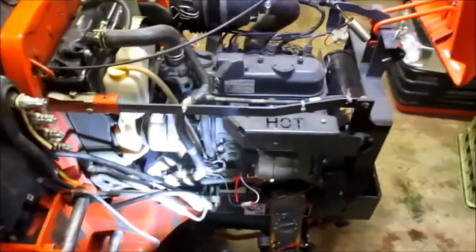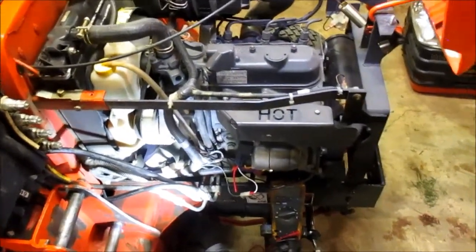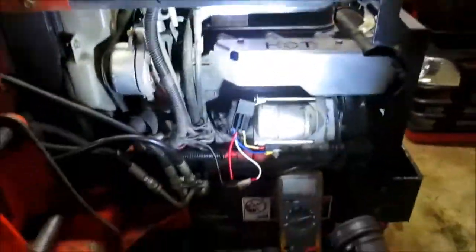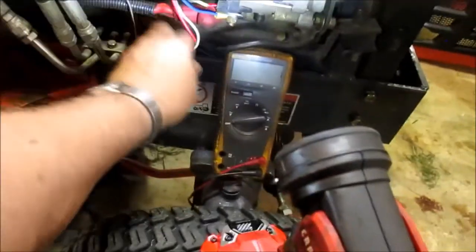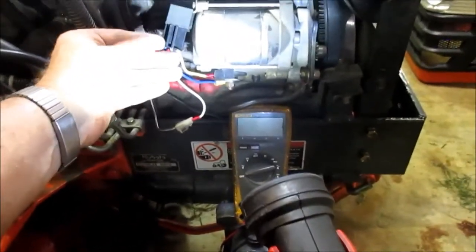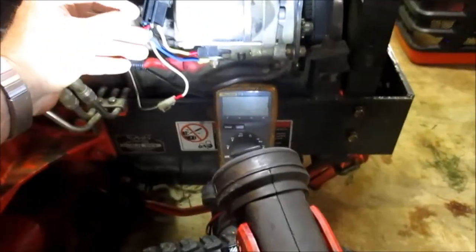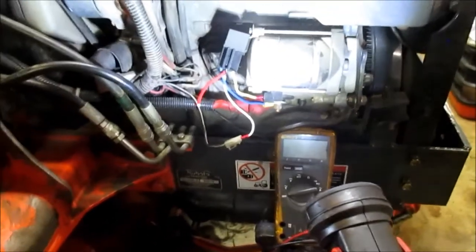What I'll do is show you on my bench the relay itself and maybe make up a schematic so you can see. Just to show you again how I've mounted it — I've just mounted it actually to the starter solenoid right here. I'll bundle the wires up out of the way. With the relay unenergized in the normal state, 12 volts is sitting on that, so I'm going to tape the end up so there's no possibility of it shorting out.